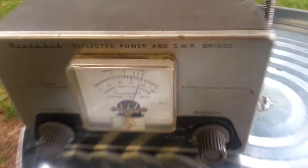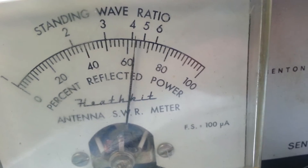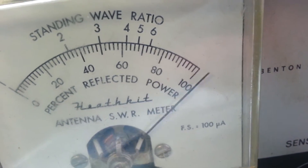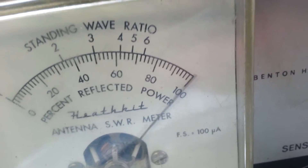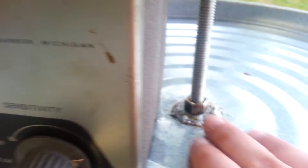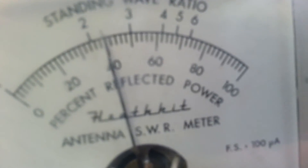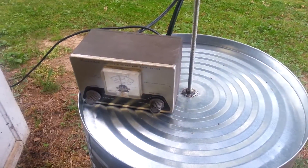Okay, let's just double-check our settings really quick to make sure I haven't knocked or bumped anything. We are kind of out of alignment — the SWR jumps up, we're still kind of high. What I did was I held down this nut and tuned it down. It looks like this is going to be the lowest SWR we're going to get. So with that, this is K5DVT showing you at least the proof of concept duplexer for the repeater.